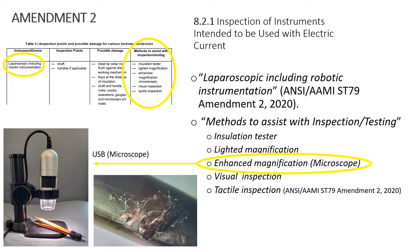What's really important about using enhanced inspection after you've tested those devices is looking at root cause. You can't just find damage, replace it with a good instrument, and move on. You need to look at root cause — maybe it's the same type of damage, the same type of scrape — to determine it's actually the container causing the problem. Maybe you were blaming the OR, and the OR was blaming SPD, and it turns out it's actually a third-party issue and an easy fix — just the way it's being arranged.